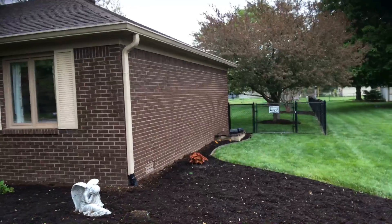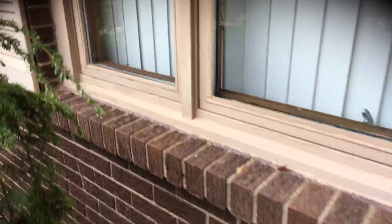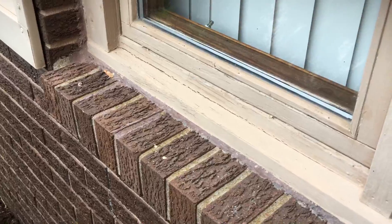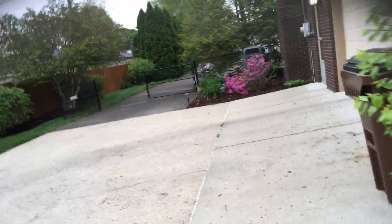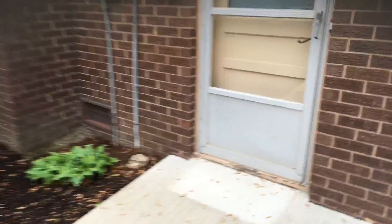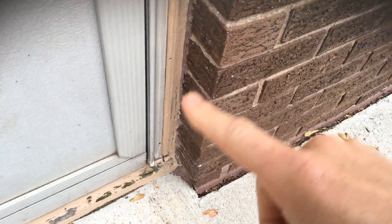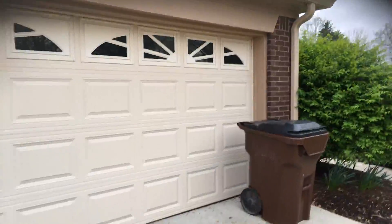On this side, nothing much. On the front, we've got a little bit more peeling — you can see that down at the base. You've got some windows that are peeling and need to be re-sealed along this area. Same thing with this window; they get a lot more wear and tear. You've got this area here — just the soffit and gutter board. You've also got peeling along this door jamb that needs to be re-caulked along the brick line. You've probably got another year or so, but just want to highlight that garage door frame.